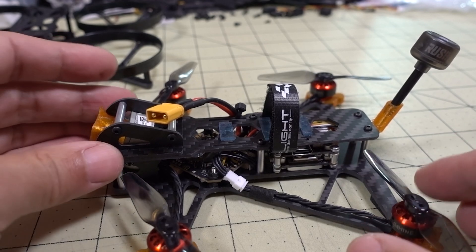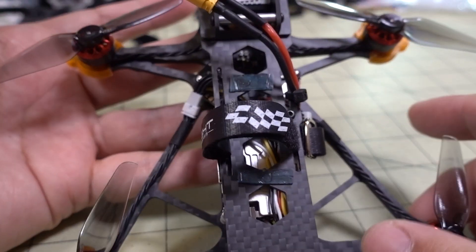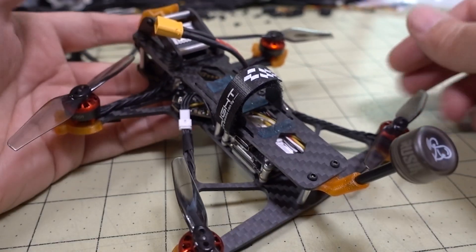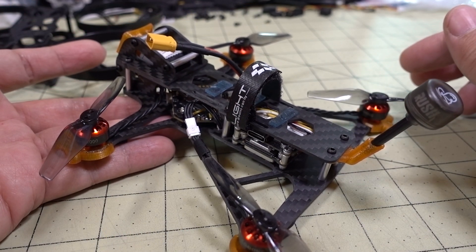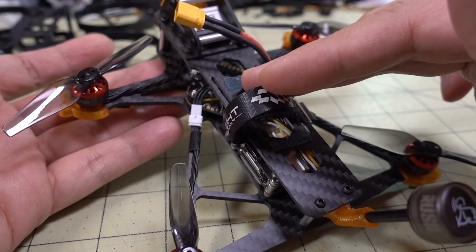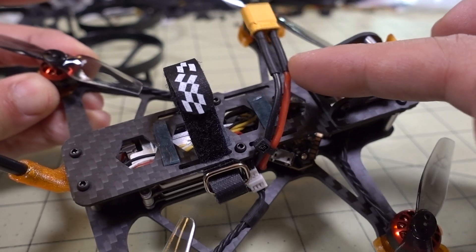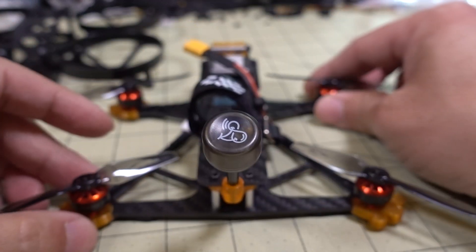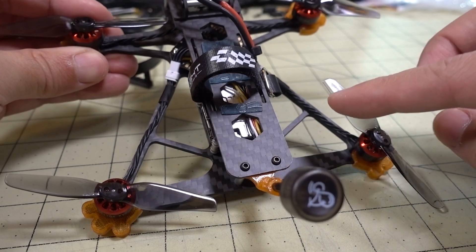Besides that, everything else is the same parts from the VizWhip just transferred over. The flight controller is going to be reoriented, so you're probably going to have to use my CLI dump — I'll link that in the description — because you'll need to remap the motors and check motor directions. That's probably the most difficult part of this transfer, especially for beginners. In my case, I have the USB port coming out the back right side, and the power cord comes in there with a zip tie to the top plate. That means the yaw orientation is reversed 180 degrees, so all the motors need to be remapped.